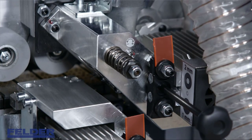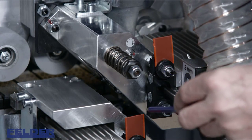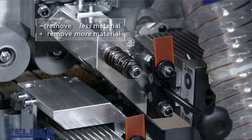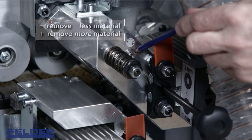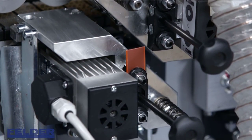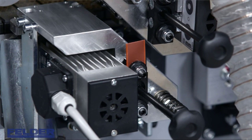The horizontal position can be adjusted by loosening the lock nut and adjusting the thumb nut. It works independently for standard edges or for thin material. Secondly, the vertical position can be adjusted with the Allen screw. The adjustment process for the bottom trimming unit works exactly the same way.